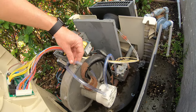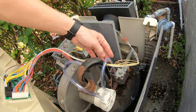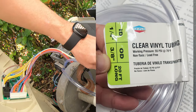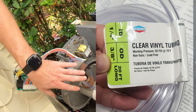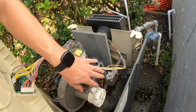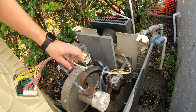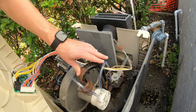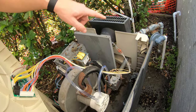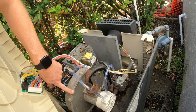All three vacuum hoses are chewed up — and this is an easy fix. The hose is one-quarter inch inside diameter, three-eighths inch outside diameter, rigid so it doesn't collapse. What's happening is the blower intake is not providing suction to these sensors to allow them to open and let the gas flow. Once I replace these three hoses it should work. I'm also going to put some mesh around the heater to keep the rats out, and I'll show you what I did after I'm done.